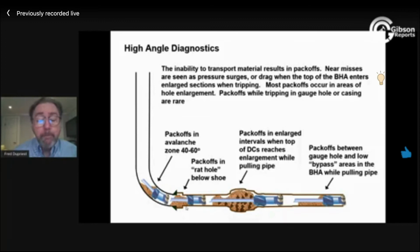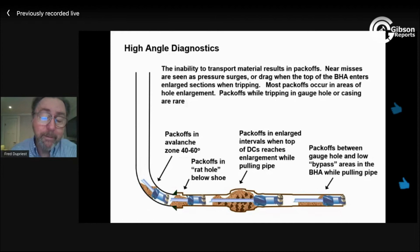Remember your rat hole, especially offshore where we leave so much rat hole. What I was simulating in that video was an 8.5 hole going to about a 12.25. Well, that's our rat hole. 12.25-inch rat hole. If you leave, you know, 20 feet, you probably won't have a lot of trouble with it. But if for some reason you end up 80 to 100 feet off bottom, and your flow rates and all that are kind of marginal, you could see a lot of trouble getting your BHA up through the rat hole that you left because of the stored mass that's going to be in there,